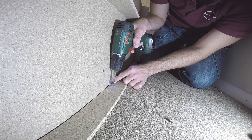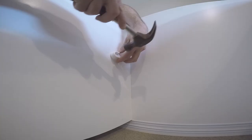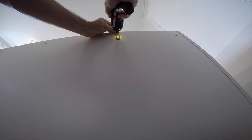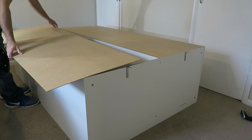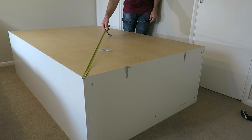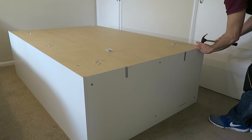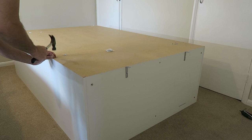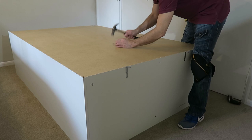The front one has an L-shaped bracket, which is a good thing — it secures the slim bottom panel so it's not going to break when you position the wardrobe. Unfortunately the middle one doesn't have that, so be careful when positioning the wardrobe. The plastics for the hanging rail and L-shaped brackets — place them on the top; we're going to attach the wardrobe to the wall later. Back panels: we're going to have two back panels in this wardrobe, just place them in nicely. Everything has to line up, and we check if the wardrobe is in the right position — that means 90 degrees on each corner, so measure from corner to corner and the numbers have to be exactly the same. Then place nails all around, starting with the corners so the wardrobe doesn't move, then secure the middle.